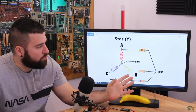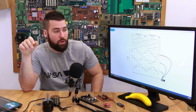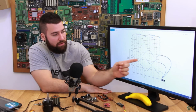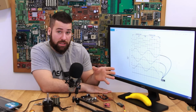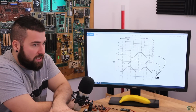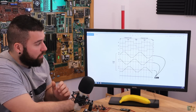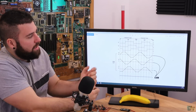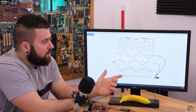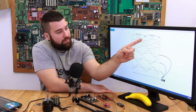Okay. So now we know how to get a common value, and now we know how to use the op amps to compare the outputs. But in order to know why we switch exactly when we pass that 0 value, that virtual 0, we have to take a look at the back EMF from the motors. This is a representation of the back EMF from the motors, so this will be the signal that you will see if you connect the oscilloscope to the output of the ESC when it's connected to a brushless motor. And here we have the pulses that we are applying to the coils. As you can see, this is an electrical cycle and this is another electrical cycle, so each one of these is a 360 degrees rotation. So we have those 6 steps that are repeating from the sequence: step 1, 2, 3, 4, 5, and 6.